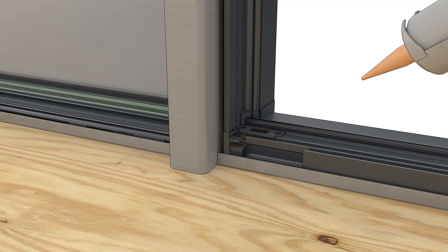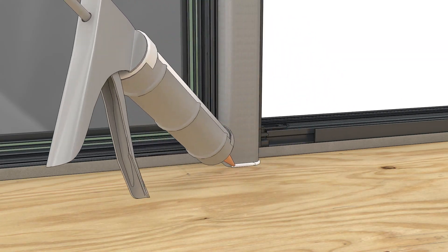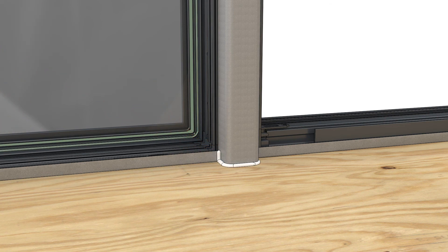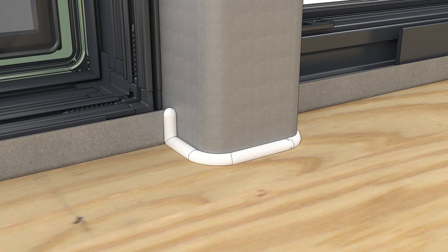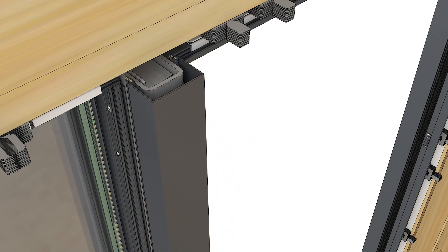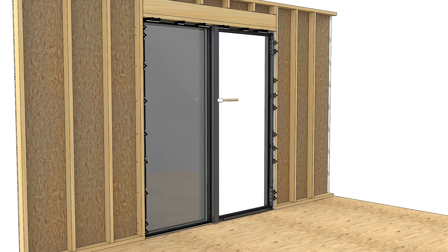If the tube or flat steel interrupts the back dam leg in your sill panning, you'll need to alter the panning to accommodate the structural member. Seal around the tube or flat steel mull cover, after mulling is complete but before you install the interior mull cover, in a manner so that incidental water cannot pass to the interior. Install the interior mull cap and seat with a rubber mallet. The structural tube steel mulling on your swinging door is now complete. Be sure to view other related videos at our YouTube channel or visit www.marvin.com.